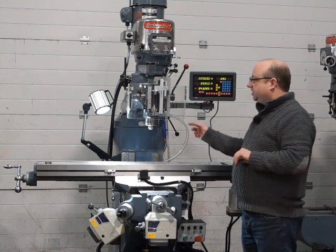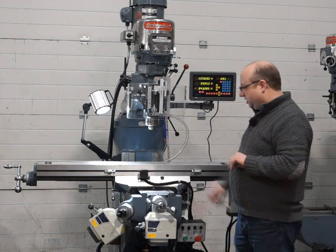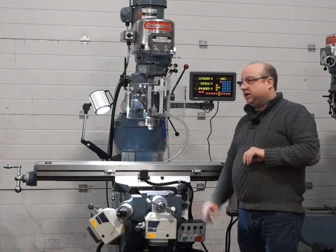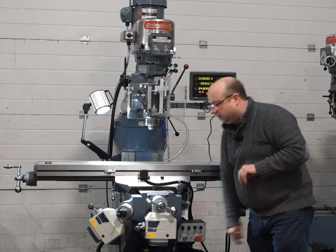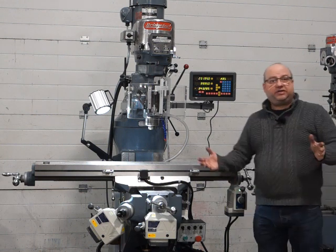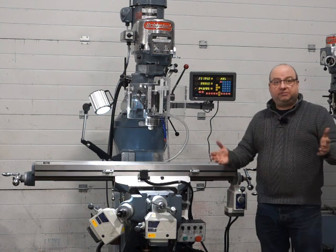There's also a guard here — this will turn the machine off if you open it, bringing on an e-stop condition. All the power feeds go off and the spindle would turn off if it was running. To reinitialize it, close the guard again and press the green button at the bottom, and then it's back on with the power feeds restored. Demo over — beautiful machine. Please come down and see it for yourself in real life, and many thanks for watching.